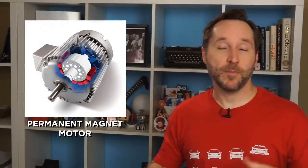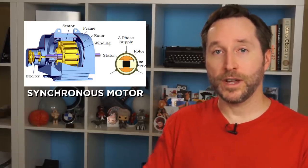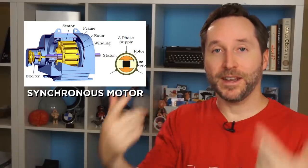Just like the four-stroke engine is the basis for many different types of internal combustion engines, this is the basis for many different variations of electric motors. What I just described is a type of permanent magnet motor, because it has magnets on the rotor that get pushed and pulled by the RMF. Another type is a synchronous motor, which has its own coils in the rotor that lock in sync with the RMF created by the stator. There's also a type that uses coils in the rotor reacting with permanent magnets in the stator — basically the opposite. And then there's a switched reluctance motor, which is actually what's in the Tesla Model 3. Some designs even flip the rotor and stator, with the rotor on the outside. If you want to know which motors go in which EVs, I'm doing a collaboration with Nikki over at Transport Evolved — she'll cover the different types of popular EVs and what motors go in each one.